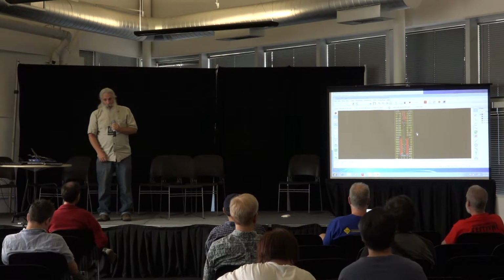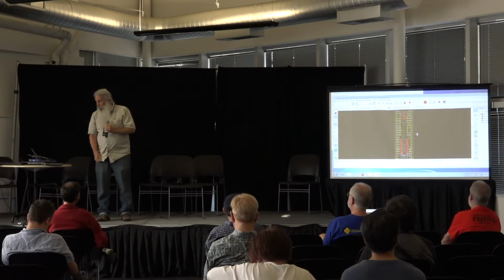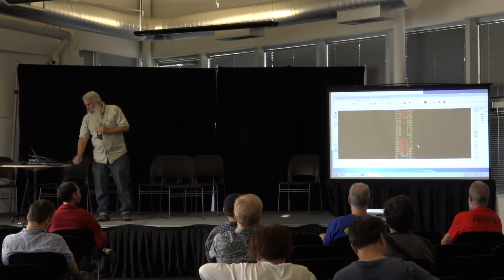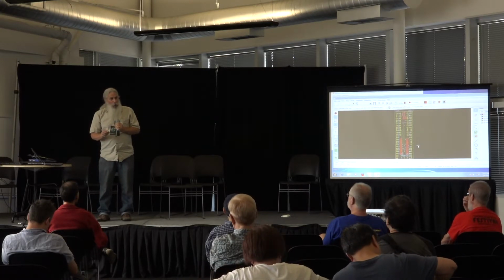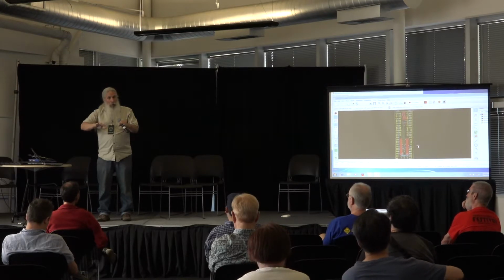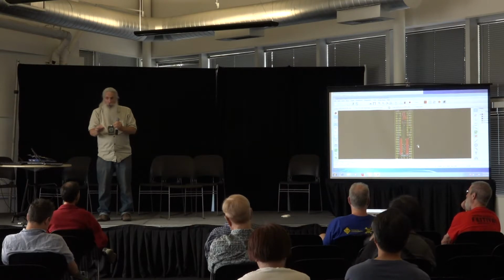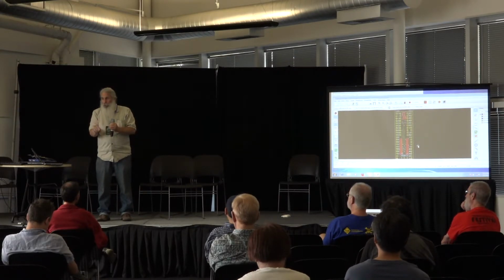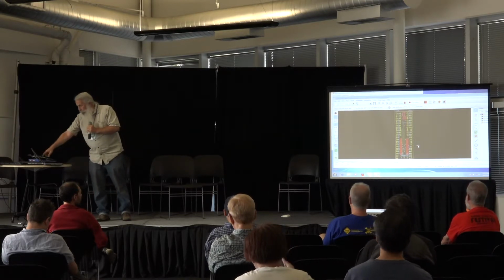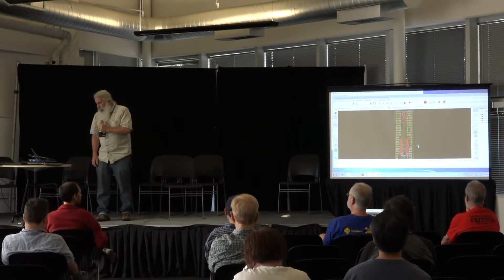for doing address decoding and the write enable for the E squared memory. Below are the pads I put in for the E squared memory. Even the E squared memories that I was able to get are a flat pack that lays the leads out this way. And I actually had to fold the leads under, flatten them down, and planarize them on a piece of sandpaper in order to squeeze them into a narrower pad arrangement. So I created all these pads myself in order to do that. And that worked out pretty well.